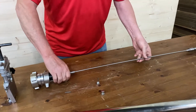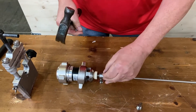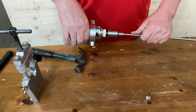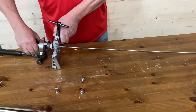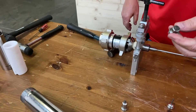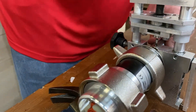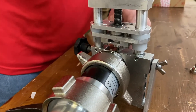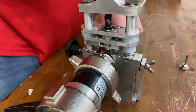Then you lay this down and set it on there. You want to put the pin back in — make sure the three marks on the end are on top. That's where you press it in and the smooth one goes in. Set it in there and just tap it a little bit. This way you can take this piece off and put it back in your removal tool, which is also used to press it back in. Set it back in here. Once you have it set in, go back to your flat piece — this will be used to press it back into place. Tighten her down. Now your pin is back in place.